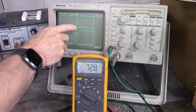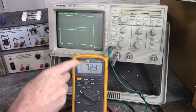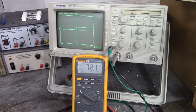You can see right here at 72.5 volts DC, the switcher's trying to come up. They're starting and stopping. You see that? There we are. There's 203 volts DC on that power supply input, and we have plus 15 volts DC. That looks good and steady.